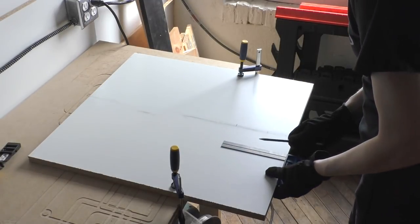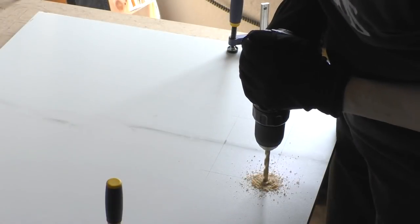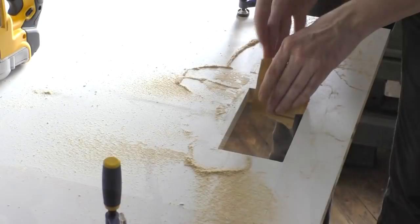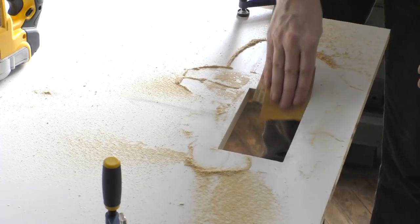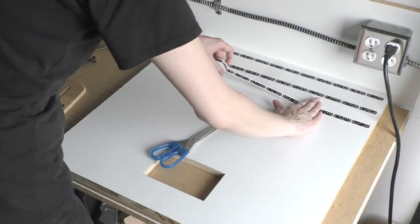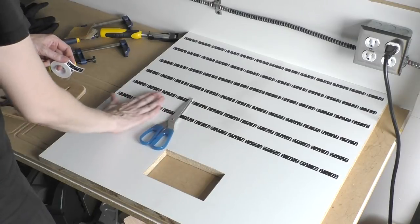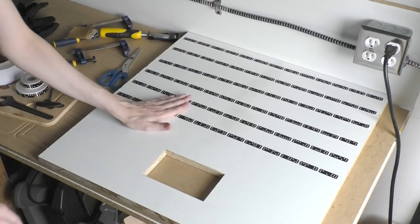I knew I was going to use the shaper to do some of the critical dimensions and initial milling, then do some hand work on these parts — getting as precisely milled as possible. In order to do that, I was going to have to make a new platform on which to mill these small pieces out of walnut. So I took a piece of melamine and chopped it down to fit on my work table, and cut a window in this sheet which was going to be 3½ by 6 inches — a standard size for these walnut blanks — and finished up the window so it would be nice, clean, and square with the board.